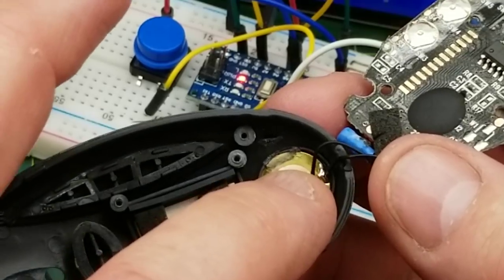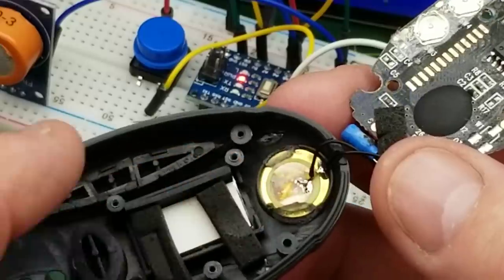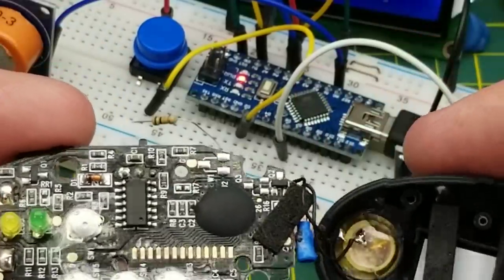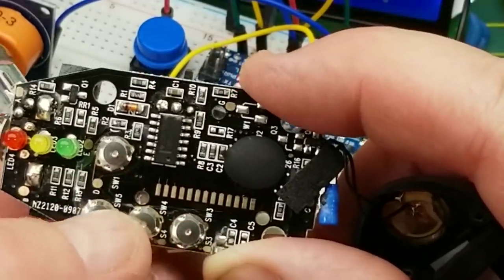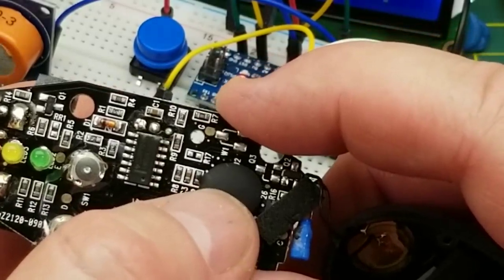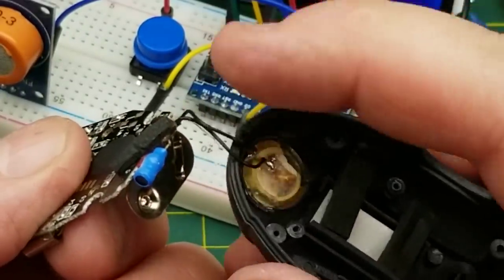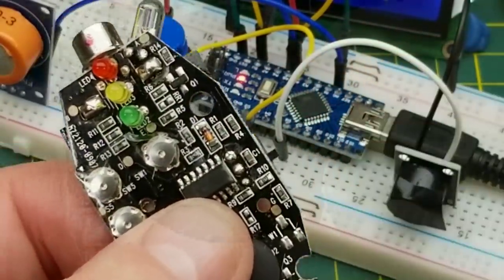So on this side, we have a little piezo buzzer. There is that display screen for the timer, and it's got a little zebra stripe there. And then some push buttons to go down onto the little tactile dome things here. So there is the power button, and there is the three clock switches and the three LEDs. We have a blobby chip. Of course we do. We have a capacitor down there. It's to smooth out the noises going to the beeper. And we have one actual chip that we can look at.